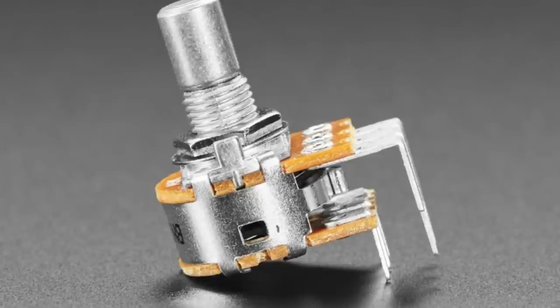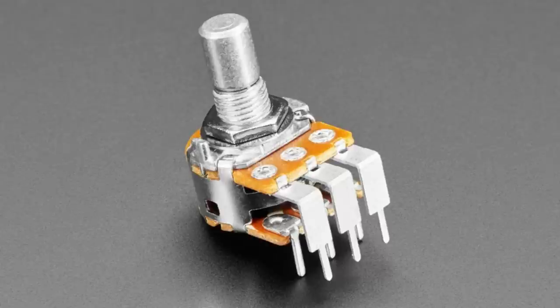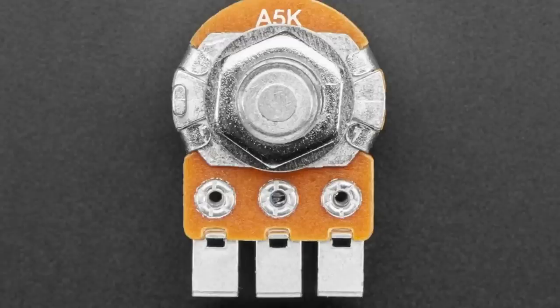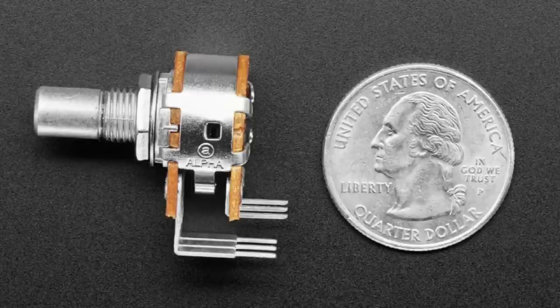Although there can be some other uses like tuning or fading or mixing, where you want 2 potentiometers that are matched. They're synced up. So these dual gang pots will do the job. They have 0.2 inch spacing. You can use them in perf board. They're often used in synths, mixers, DIY audio projects, panels, modules, etc. We want to stock a collection of alpha pots, and it's just easier to get one of each. So now we have one of each.